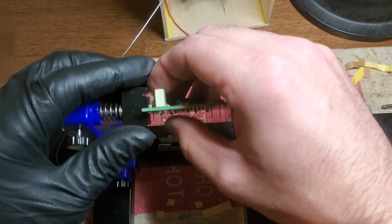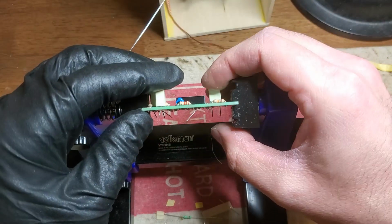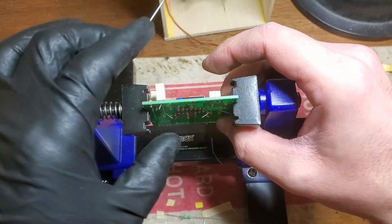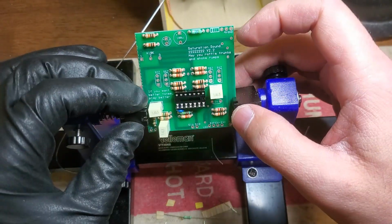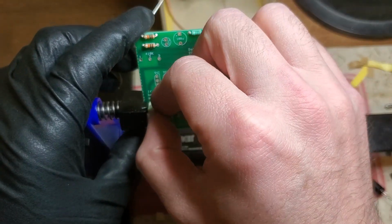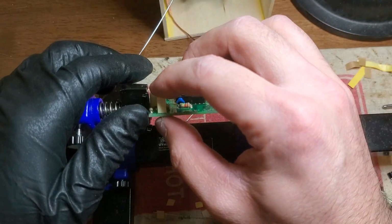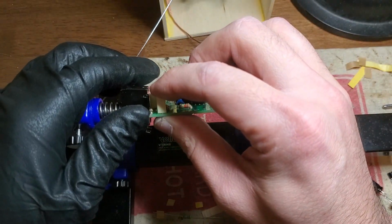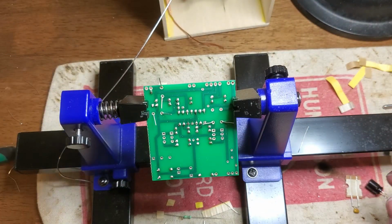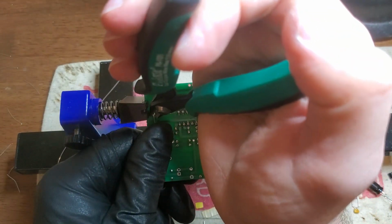That minimizes the amount of high passing that you get. And even though I'm using fairly large caps and those high pass points should be, you know, almost subsonic, I do have a slight flaw in the output, which could potentially bite into some low bass range. At least that effect isn't compounded by the increasing slope, as you have, like, you know, more and more and more stages of coupling.